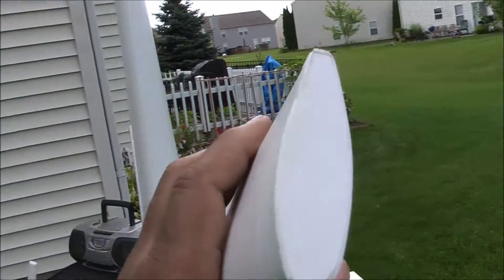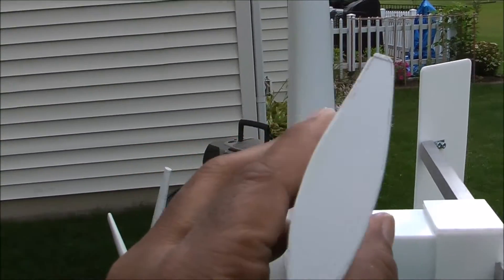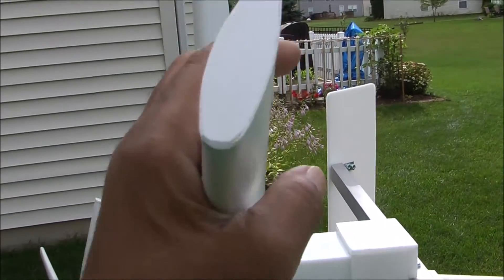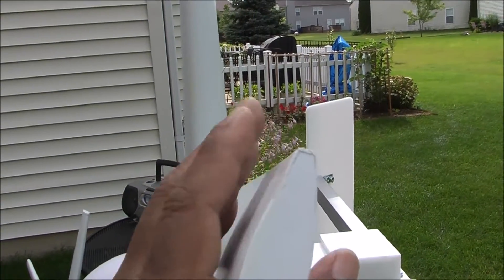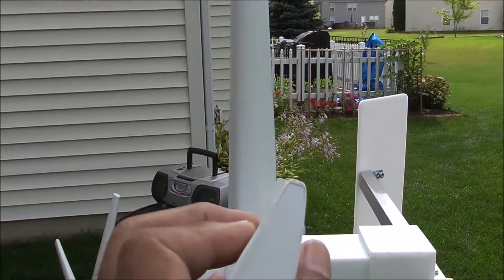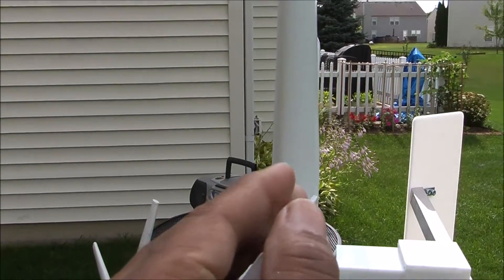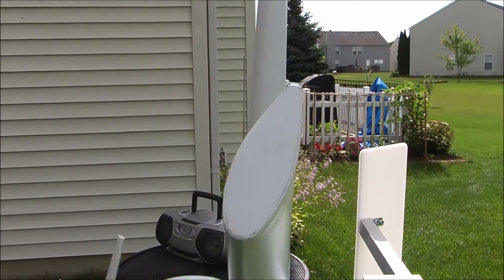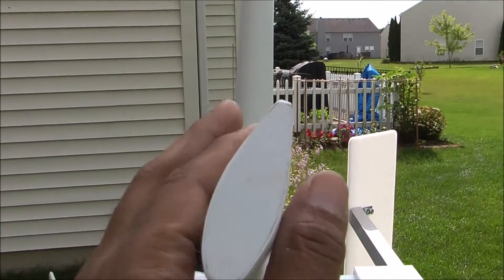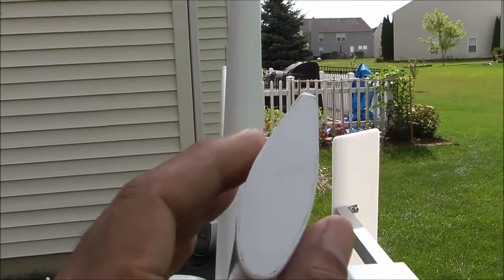You can see that here I've elected to give it lift on both sides of the blade. As the wind comes through down and through like this, we have a high pressure on this side and a lower pressure on this side, which means that the air coming together at the back of the blade becomes much smoother, so that the next blade will come around into smooth air, generating nearly the same amount of power. That's why you want lift on your blades.